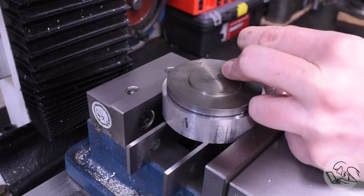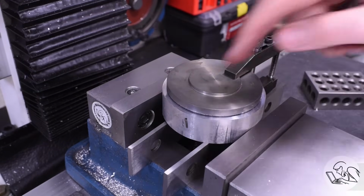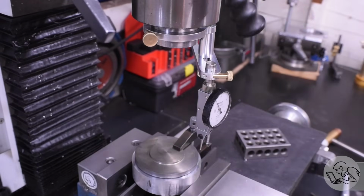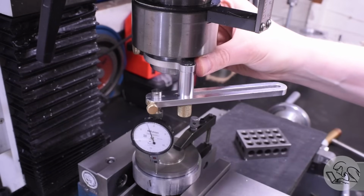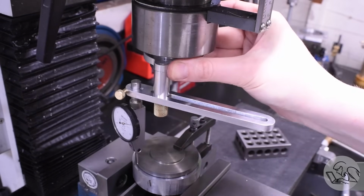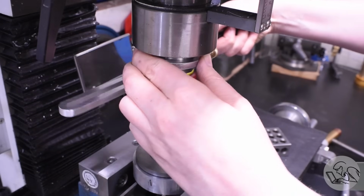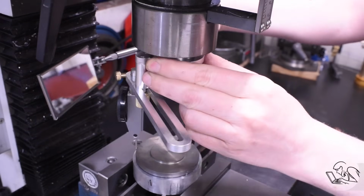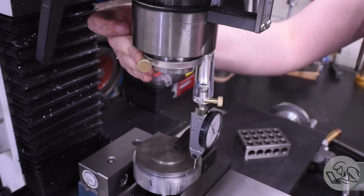I need to clamp it in place to this aluminum as you see here, but now the OD is not available for the coaxial indicator, which I might normally use for this. And that little shoulder there is too short for the coaxial indicator to read on. So this is a perfect case for a DTI holder like this. I can use the DTI holder and indicate within the 340 degrees or so that I have access to with the clamp there, and I can dial it in thusly.